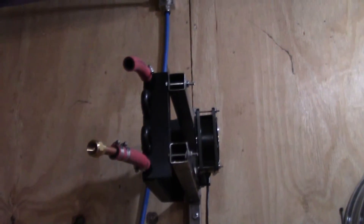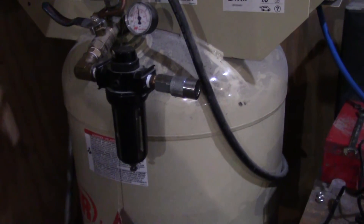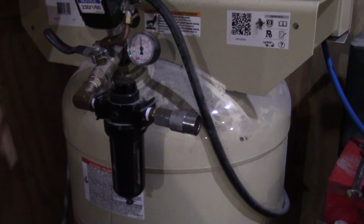It just pops open for a second. Let's see if we did get some water out of there. I could put this outlet on here and direct that flow backwards that way. I think that'll work. Most of the time when I'm not using this compressor I'm just going to unplug it, but hopefully this will keep a lot of water out of the air. When I get ready to run a cooler into it I'm gonna plumb it in after the tank. I'll be working on that and bring you back next video. Thanks for watching — please rate, comment, subscribe and hang in there.